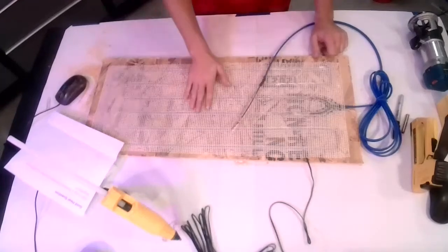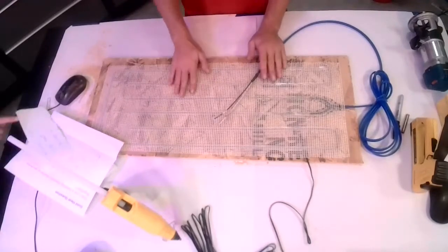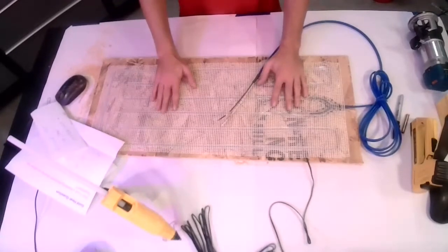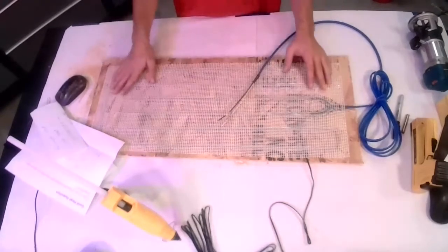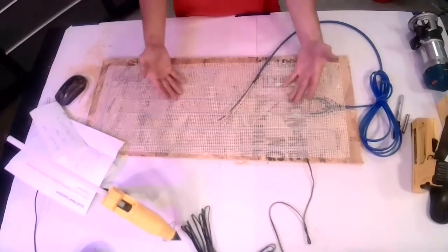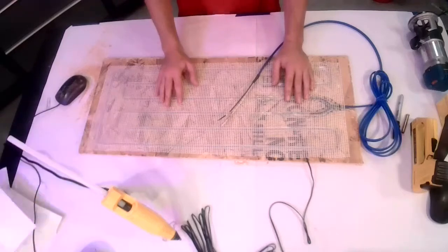Yes, can you cut the mat and splice it and make it shorter? No. I can't say that enough. No. The mat is customized when you order it. So the way the process works is you give us a drawing of the space, and then we give you back a drawing that has the heat mat drawn into it, and you approve that drawing, and then we go from there and actually manufacture it. So it is not something you can customize after you have ordered it.